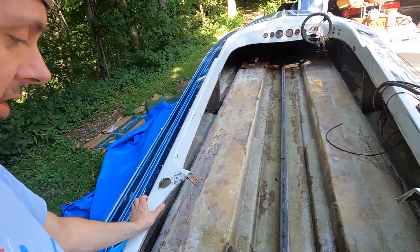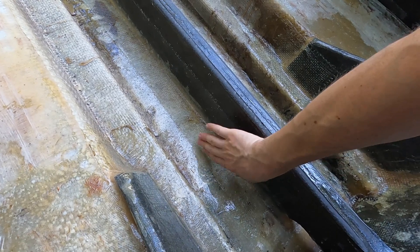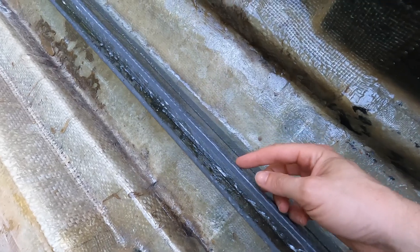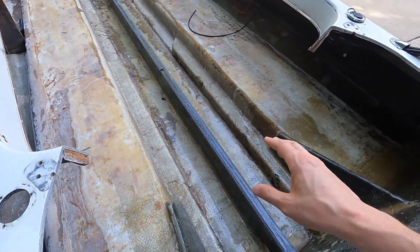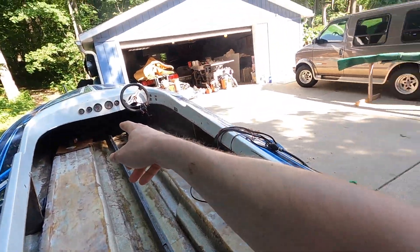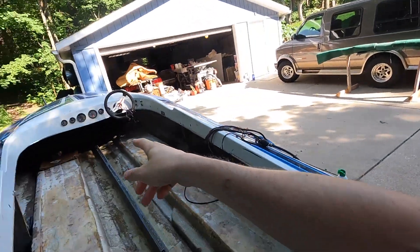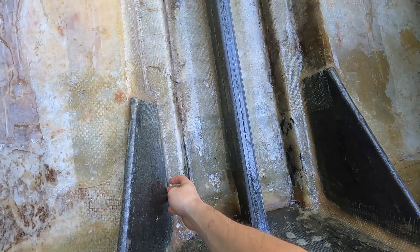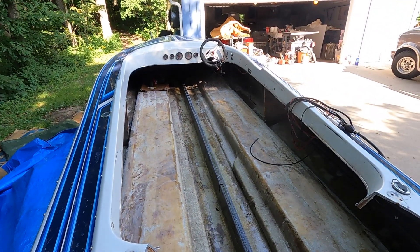Alright, so here's the current state of the hull. It looks like we got a really good bond on this tape to the stringer, and you can see that I've started to round over the edges. This is going to help the fiberglass lay over the top of this stringer, because fiberglass doesn't work very well with 90-degree corners. So I need to finish routing this. I kind of ran out of time when the drone decided to land on the roof. I need to finish routing this and then I'm going to be cleaning up a couple of areas where I have some air pockets, so I can put another layer of glass and get even more strength.